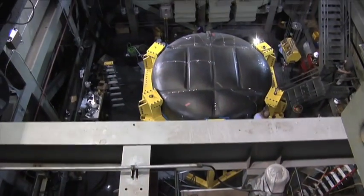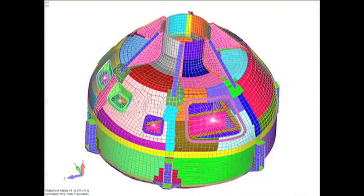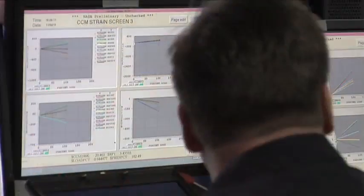When that's done, we build our article, bring it to a facility like this, and we test it. What we have right now is our article mounted upside down in a test fixture. We're pressurizing it and pulling and pushing on it. We have strain gauges to measure local deformations so we can determine how much load is there. We run it through a series of conditions — we've done about nine conditions so far. Our big one is pressure: we pressurize it and measure how it's stretching and deforming in real time. All that data comes back and confirms whether our simulation of the design was accurate or if we need to update our analysis to match what we got in test.